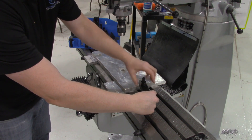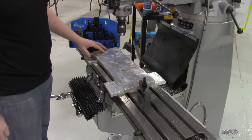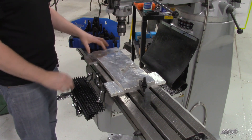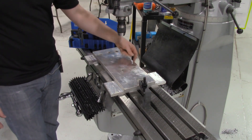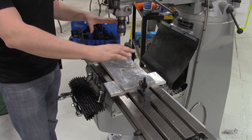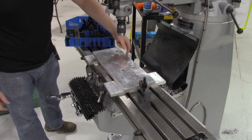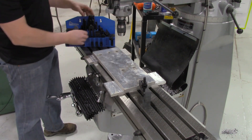With a setup like this, we're able to lock our work down. The trick is going to be making sure that this is square relative to the mill. We may have to use a dial indicator to see how we're doing, then loosen, clamp things up, and re-tighten so that we've got a nice straight edge across this dialed-in surface. That's probably going to be your best shot.